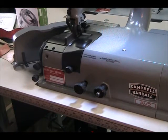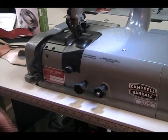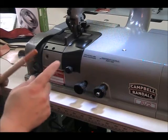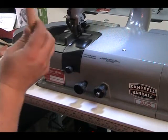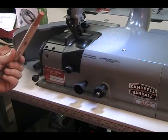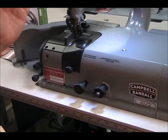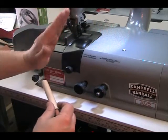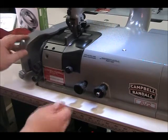Normally I just let it get contact. Now if you look down, even with the door closed, you can see the sparks happening. If you're not seeing sparks, probably your stone's dirty. You hear it rubbing, but it's not doing anything. And in your toolkit, there's a little spur wheel that allows you to go in there and dress the surface of the stone. There's also a gray stick, a wood handle with a gray stick. It's a coarser stone, and you can use that gray stone to dress the surface of the stone. When I say dressing, I'm cleaning off the dirty surface of the stone. I'm actually removing the bad surface with the tool, so you've got nice, clean stone again to grind. Again, you want sparks when you grind.